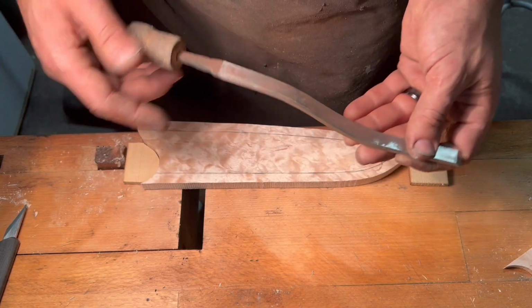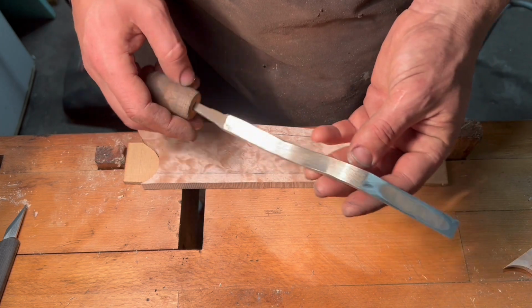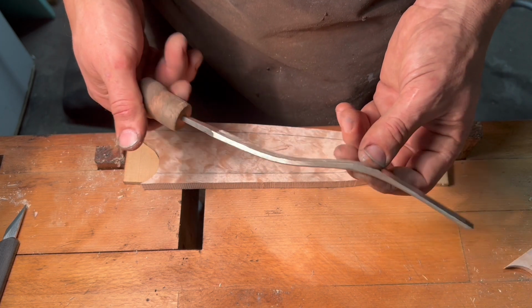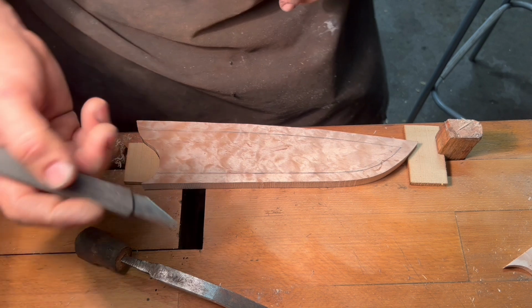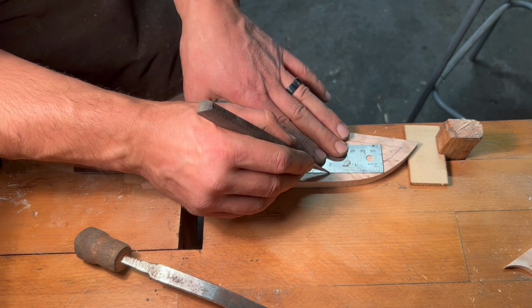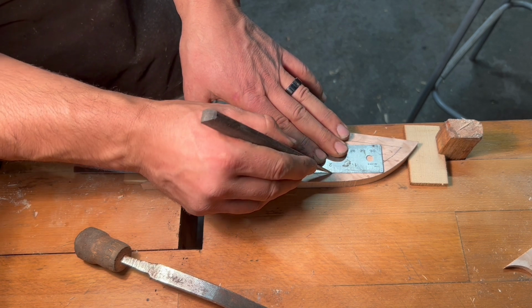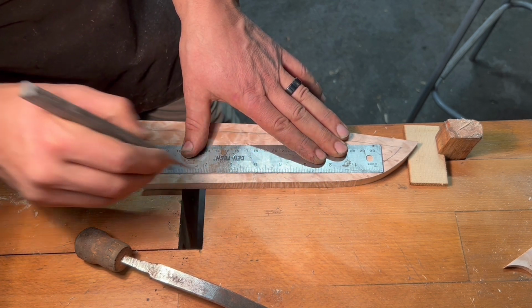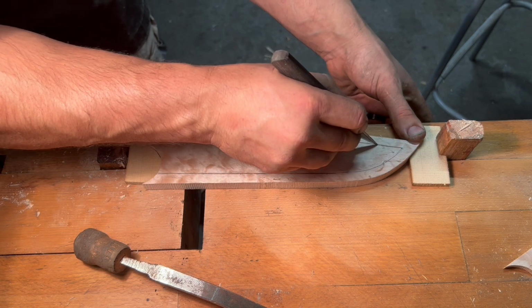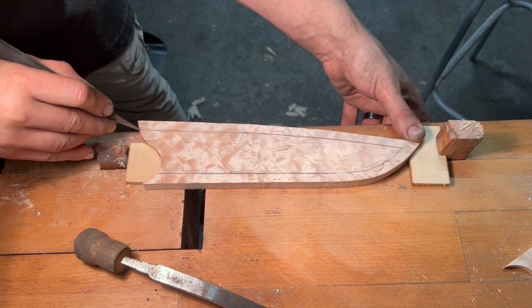To cut the inside of the scabbard, I will use this chisel that I made out of an old file, and I know it's not shaped after a proper saya no mi. And I'm going to use this woodworking kiridashi to score around the lines. It's always useful to utilize a straight edge when it's possible to guide the scoring for straightness of the cut and to protect your hands from slippage. When not possible, just try to keep your hands out of the way.